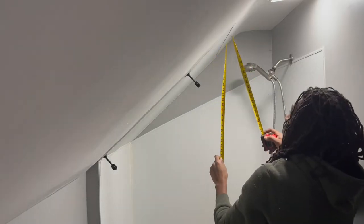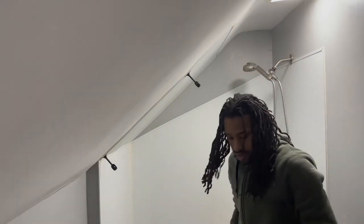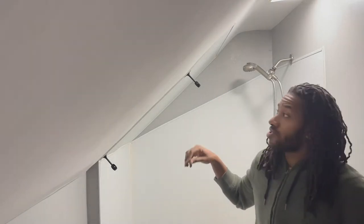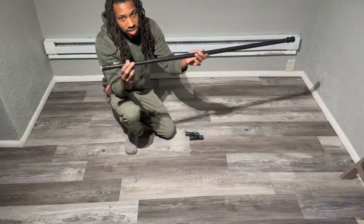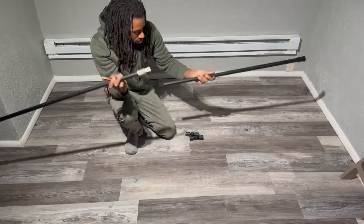So six foot is about right here, so we're going to cut my pole at 32 inches. I'm going to put my first pole in first before I take my other measurement, just so it can be precise. The standard shower rod is going to come in one piece but it's adjustable, so you pull it in and out — go ahead and separate the two pieces.